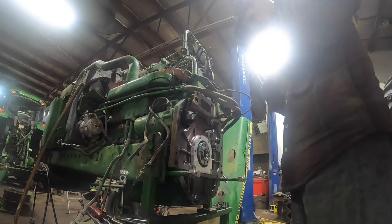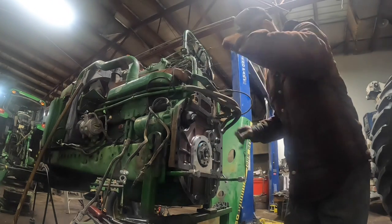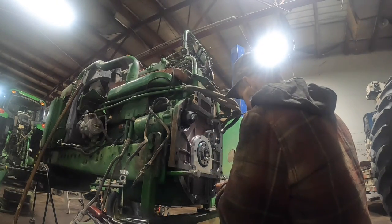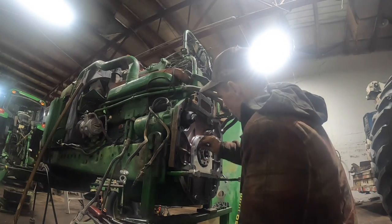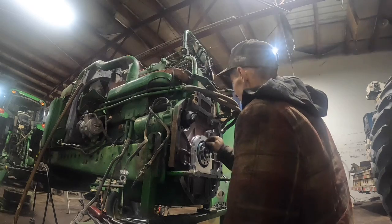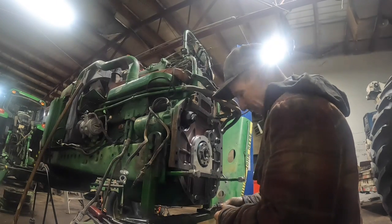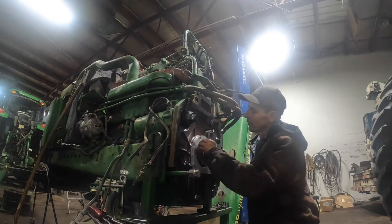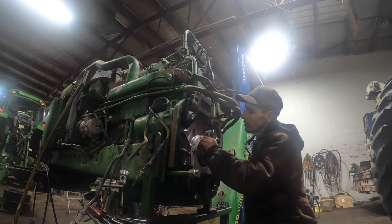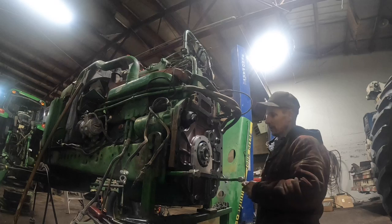These can be kind of a bear to get into to get them cleaned up a little bit. Some brake cleaning. Yeah, I bought some of that mesh looking emery cloth from Napa not too long ago, and I used it all up. I wanted some more because it worked really nice. It was almost like wire mesh, 120 grit paper, and it didn't plug up. This stuff plugs up so bad if you got any of this green shit on here, it just constantly plugs up. But they didn't have any, so I was forced to get the stuff we used for a lot of years, which I don't really care for, to be honest with you, for that sole reason of it constantly plugging up.